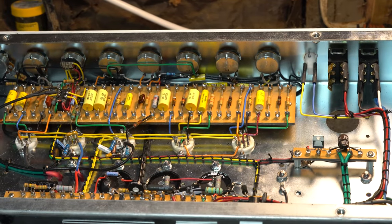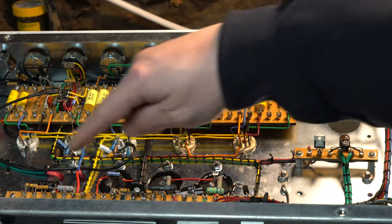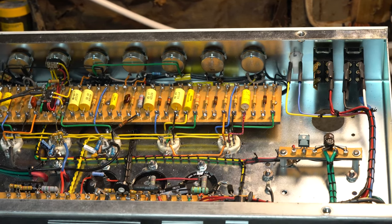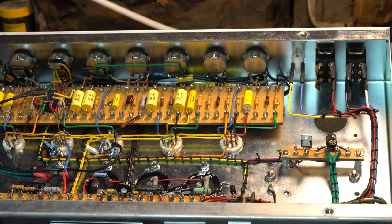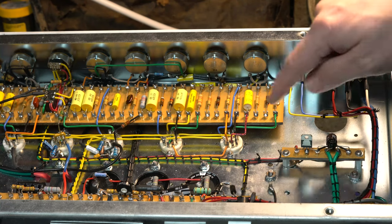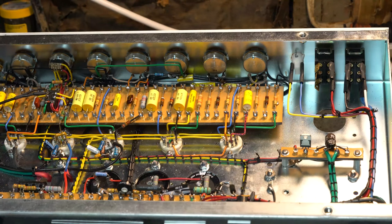It's pretty clean. You can't quite see the front side as well down in here, but that's what connects into the output tube. You can see the preamp section. Power is there on the right side with the light bulb. It comes down to a small rectifier setup right here with a small solid-state device for controlling power, and that sends off over to the relays which are here, and there's another small one up here that handles the switching.